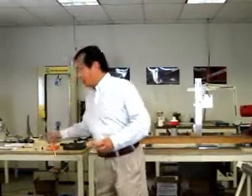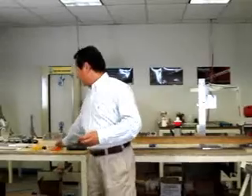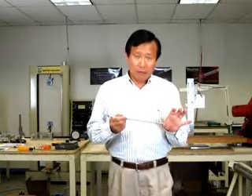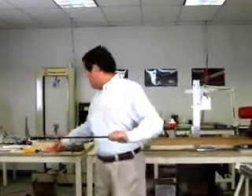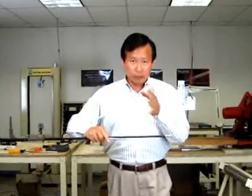What will happen if the insert tool is too short? The insert tool combined with the insert will give you the insert depth of 42 and 3 quarter inches. The legal limit for USGA and Long Drive America is roughly around 48 inches in terms of the cut shaft length. So 42 and 3 quarter inches means this insert with the tool could go all the way down to around 6 inches near the tip section of the shaft. It is our intention that we don't want the insert to intrude within the first 6 inches of the golf shaft.